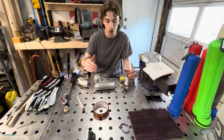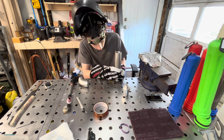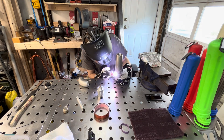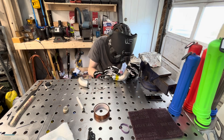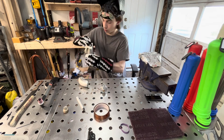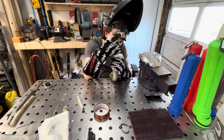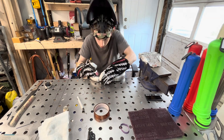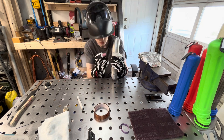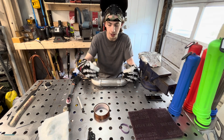We're going to purge our tacks as best we can at 10 CFH. Knife-edge bevels can make it difficult to get pieces lined up, but take your time and get it as perfect as possible. Schedule pipe is nominal pipe — not perfectly dimensioned — so there may be inconsistencies adding difficulty to fit-up. Avoid gaps and side-to-side misalignment. The knife edge can also make it easy to burn through when tacking, so start with low amperage, ease into it, and pick spots with tight fit-up.